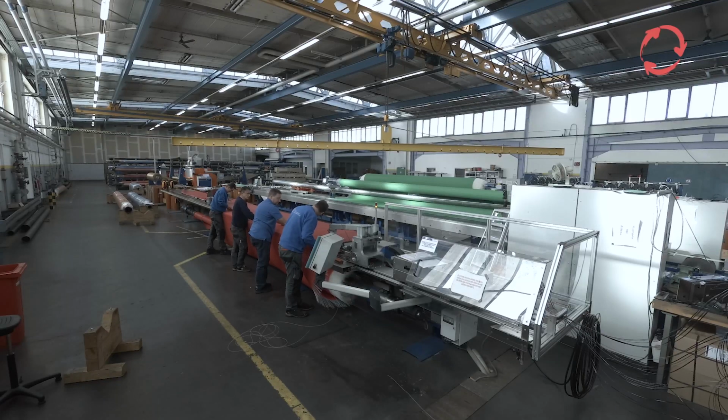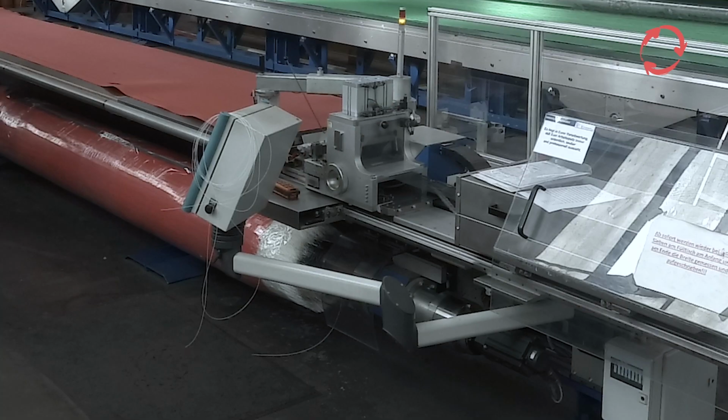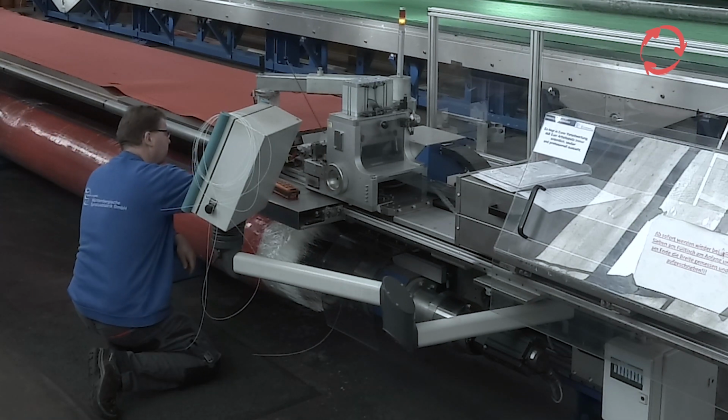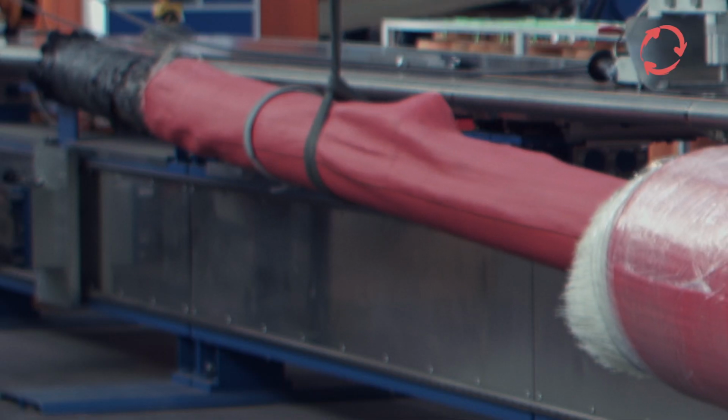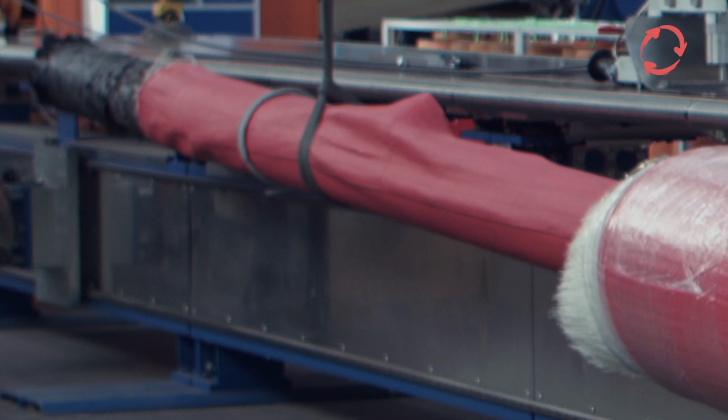After filling the last section, the precursor end section is separated from the sieve by removing the corresponding pintle wire and wound onto the front winding tube. The precursor is then secured with Velcro straps or tape. Analogous to the description of the setup process, the front winding tube is now removed, with its accompanying precursor, from the machine.